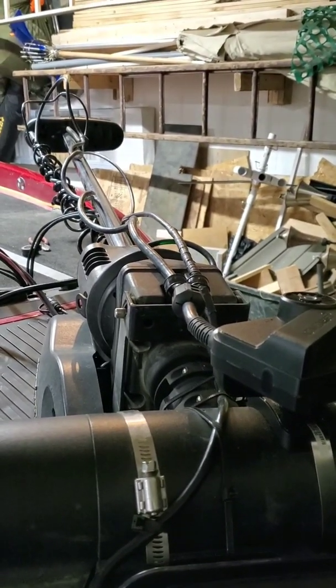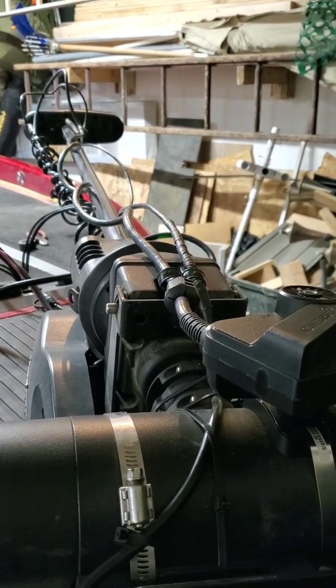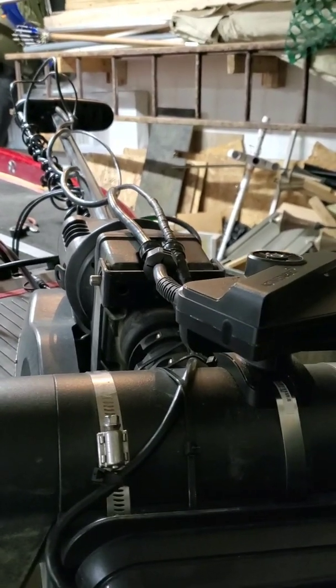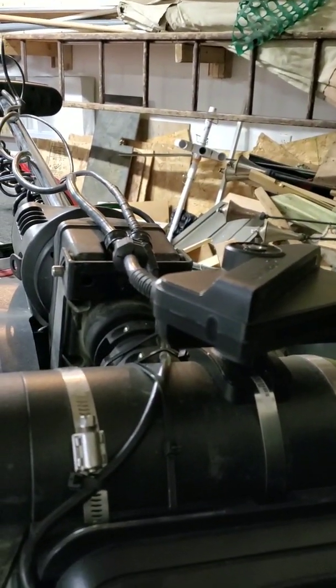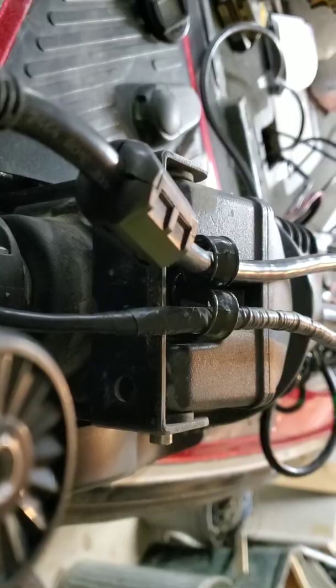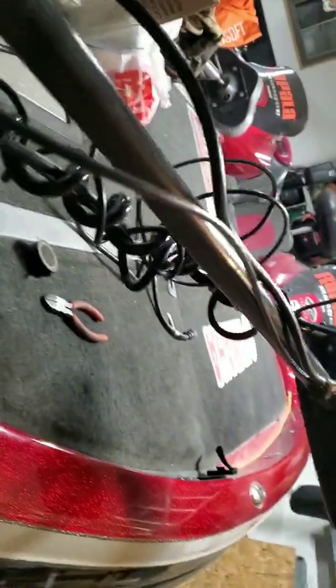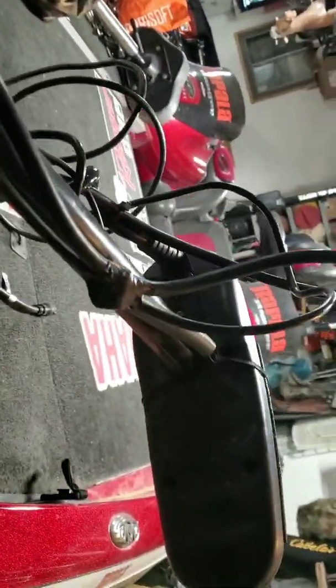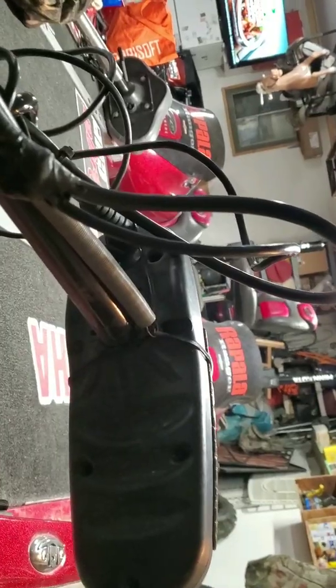V-Squared Outdoors here, back again with the active target being mounted on a Minn Kota Ulterra. Absolutely love this motor, self-deploying. So again, what I have is a 3-in-1 on the bottom, and the active target mounted to the barrel of the trolling motor. Right here are the two brackets that I made out of cable ties that allow the cable to slide through. The cable goes up. And the reason why there's two cables on here, again, is I have a 3-in-1 on here. It attaches to a spring. You leave some gap here in the head so the motor can spin around.